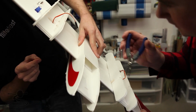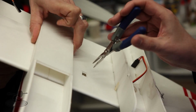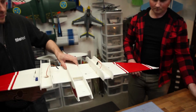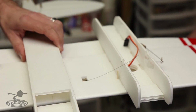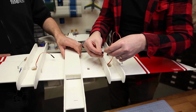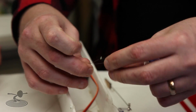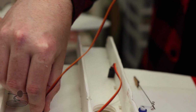What we're doing now is inserting a piano wire so we can pull the wire out through the hole. There we are. Perfect. Okay, cool. You can also probably snake it this way and go in the other way. Whatever works best for you. Okay, so what we're going to do here, you want to show that? Do you usually go like that? Or I do usually you go just hook it in between the wires and let it kind of cradle the wire. Now if you have to pull hard, don't do it. It means you're snagged on something and you're going to break something.